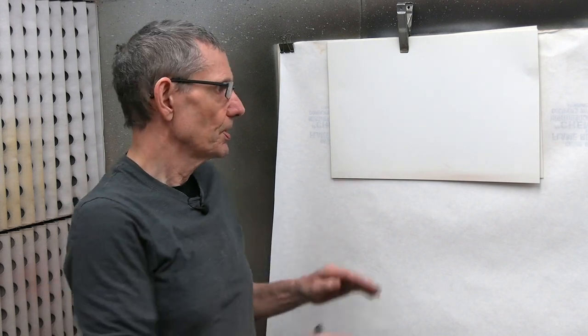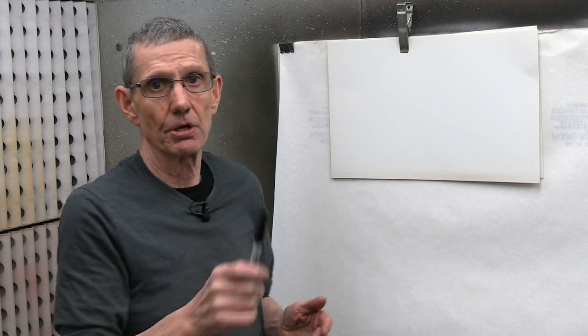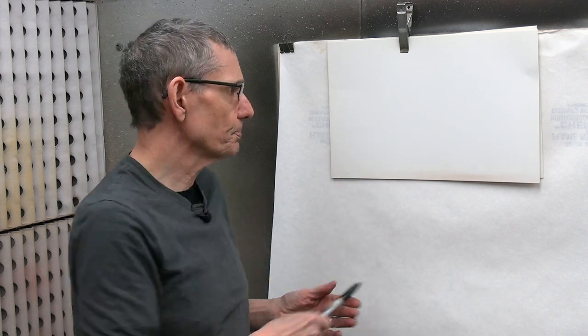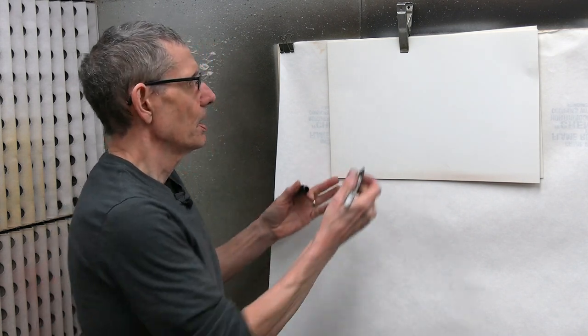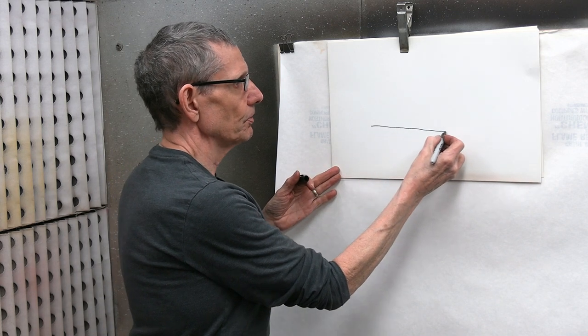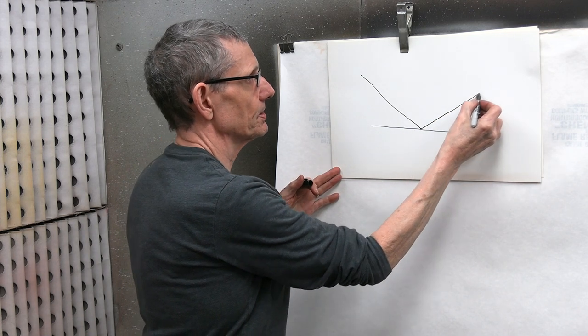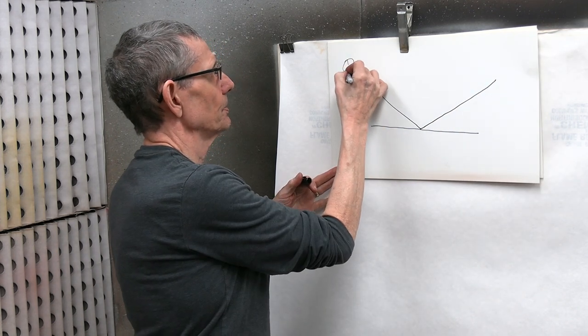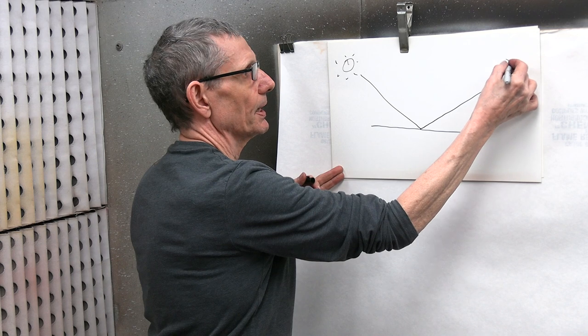I'm going to assume that what you want to do in your first or second, or when you're beginning to rub out finishes, is take it up to a gloss finish. Now, there's other sheens that you can rub to, and we'll discuss those as little detours along the way. But for the purposes of this discussion, I want to talk about gloss and how it's created. A surface is gloss when it reflects light clearly and distinctly. In other words, your light source is here, and then the human eye is here.